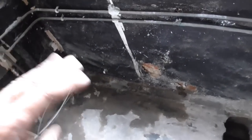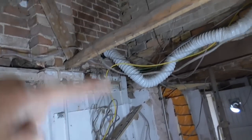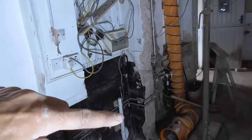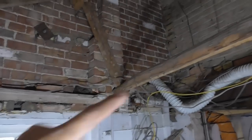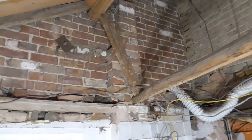So what I'm going to do now is get a measurement for a sole plate all the way through here. Might have to pack it up a little bit so it's fairly flat. Get the DPC under it, and then, as I said, we can see what we can do to maybe try and get one timber up this side, and then maybe one timber up this side, see what the level says for plumb. We might have to go with it a little bit, but then maybe we can get a line through or something, I don't know. We'll work it out as we're doing it.